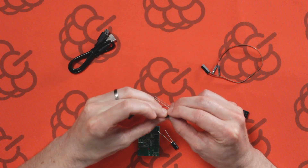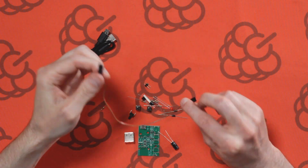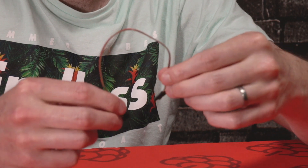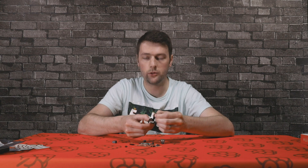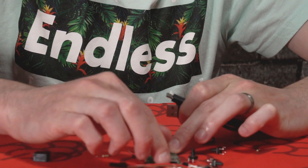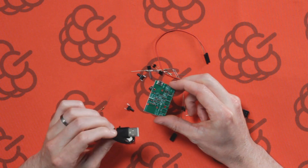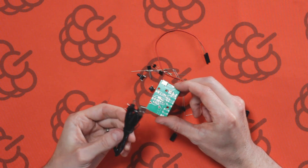We've got a couple of jumper pins. Once you've assembled it, you need to connect this jumper cable from the Pi Supply Switch to the Raspberry Pi — this will allow you to do the soft shutdown. It also comes with a USB to micro USB cable. Once you've assembled the circuit, you connect your main power adapter to the micro USB port on the Pi Supply Switch, and then connect this to the Raspberry Pi's micro USB port.